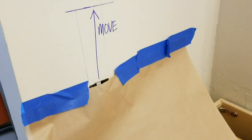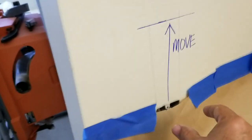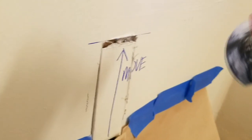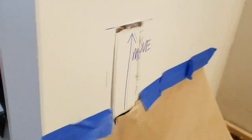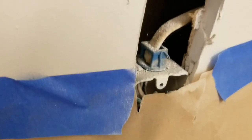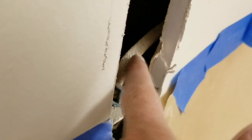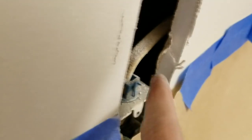So let's go ahead and start slicing up the wall. I've got some protective paper here just to shield the area from dust and debris. This is always my cutting tool of choice for drywall — my Sonic Crafter. The drywall blade sets the depth for you so you can't go further than the depth of the drywall, making it virtually impossible to hurt any wire back in here. We're going to cut two slits straight up. Okay, so we've got that cut — let's pull this piece out. You can see where we dodged the bullet: the wire wasn't even a half inch away.